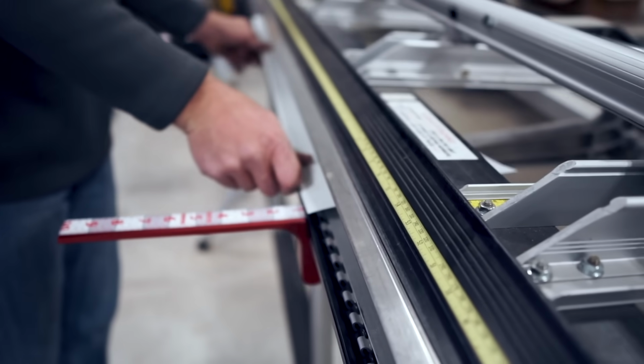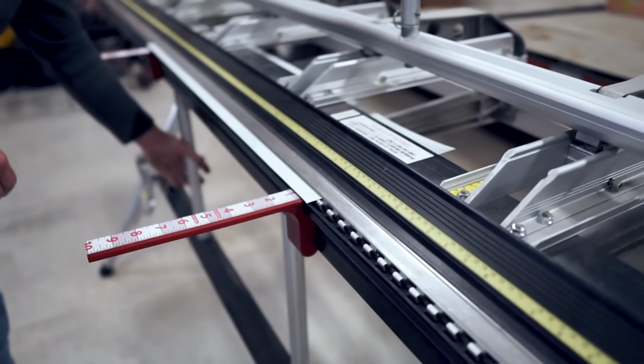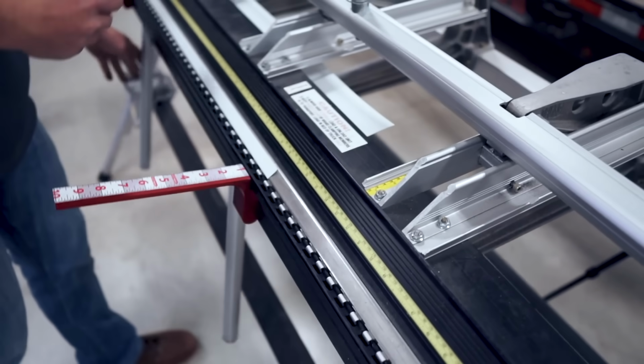All right, I got another trim for you here, and it's a piece of drip edge, so something that is commonly found on the edge of a roof, and it helps the water drip off the roof and away from your fascia so it doesn't rot it out. Now we're gonna start with another hem, so stick it into your edge, and we're gonna do that full bend.